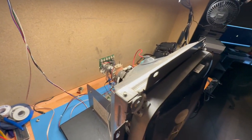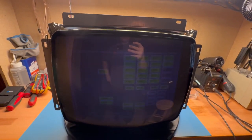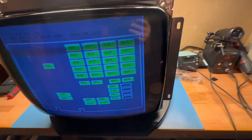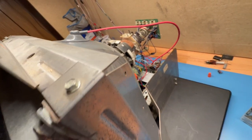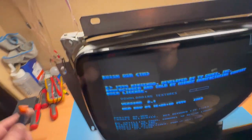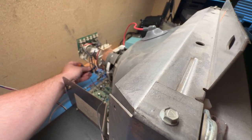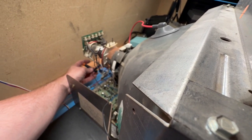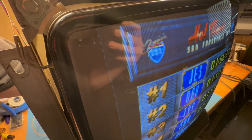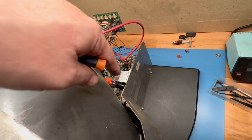Here we go, 1, 2, 3. The scope of this video was just to make sure we could get this fixed and repaired. See, it didn't really make any difference at all. It made no difference. So it's not the right width coil, but I can compensate by just putting in a different width cap here. H position. Let's shift that over a little bit. It's too far to the left. There we go. We can move that by the horizontal centering pin that's in there on the jumper.